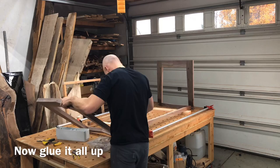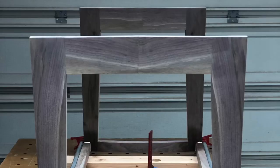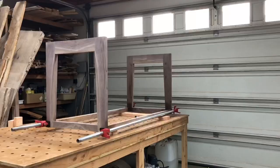If you're just getting into woodworking, or maybe you've been in woodworking for a long time, you've probably realized how expensive clamps are and how many you need. My advice to new woodworkers on a budget is to get a bunch of these pipe clamps because you can swap them into longer or shorter pipes, unlike a parallel clamp that's the size it's going to be no matter what. I had to buy some extra long — I think six-foot long — pieces of pipe for these clamps, but I didn't have to buy a new set of clamps that was going to be $70 or $80 each.